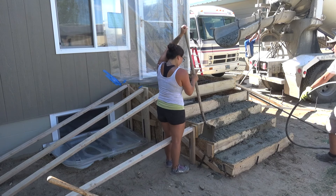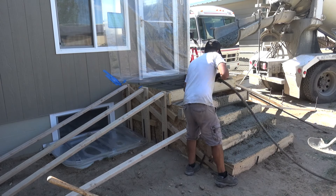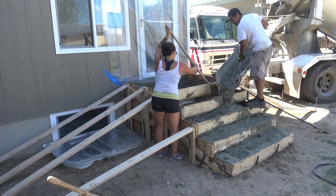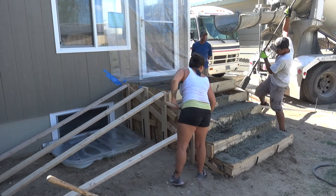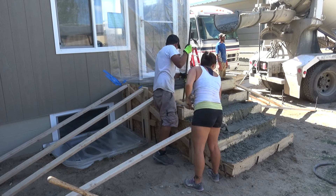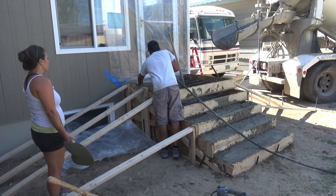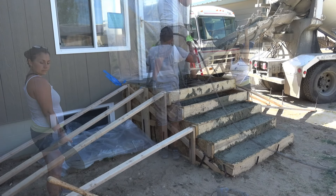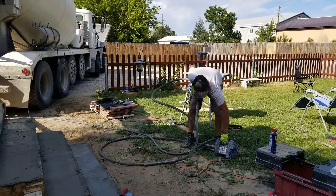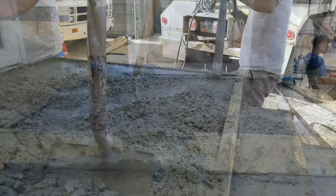That's where the concrete vibrator comes in handy. The vibrator helps the concrete settle to the bottom and fill all voids, but you have to be careful not to overuse it, because this can make all the rocks in the concrete mix sink to the bottom and severely weaken the concrete. Just a few seconds here and there should do the trick. I'm also hand-packing the outer edges of the forms to make sure the concrete fills around the steel H-beams. I continue to hand-pack and use the concrete vibrator with every one foot of concrete poured. Near the end of the pour, I use the vibrator one last time, again being careful not to vibrate too much.